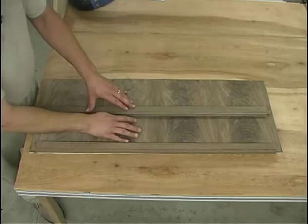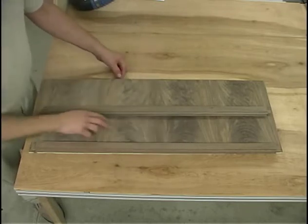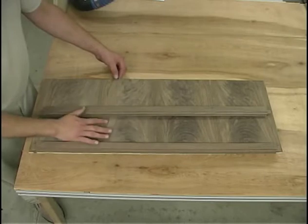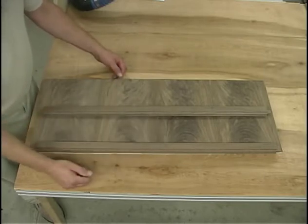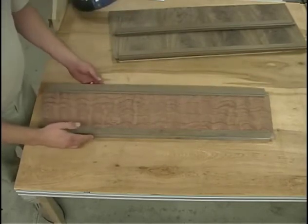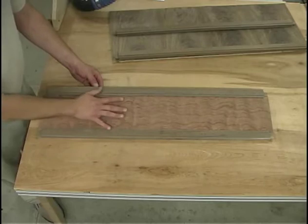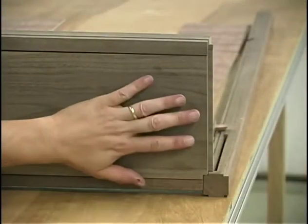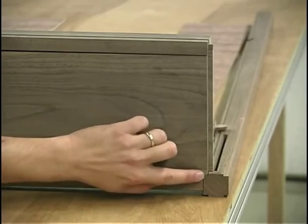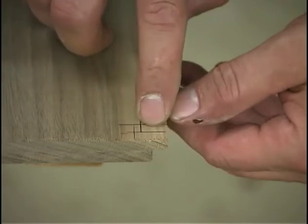We're going to have a field panel made out of quarter-inch thick plywood. I was going to use crotch walnut plywood, but it turns out I didn't have quite enough. My next alternative would be to buy another sheet of quarter-inch plywood, but I have some bubinga plywood, and the bubinga is adding quite an interesting visual effect — it's got this real wavy grain pattern. The coloring is a little different, but the texturing is very similar, and I really like the looks of it. You'll notice that where the top panels meet up with the front and back legs, there's a small area that we need to notch out. We do have to allow for a little bit of growth in this area, so don't try to get it fit just perfect — you do want a little bit of extra clearance. It only takes a minute to very carefully lay out the area we need to cut away.